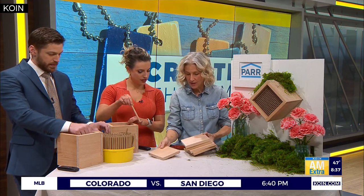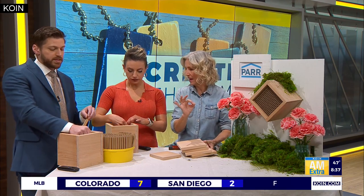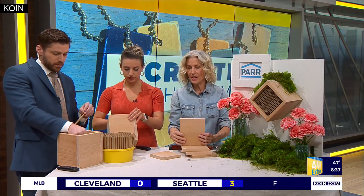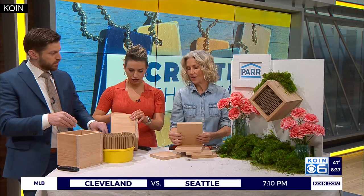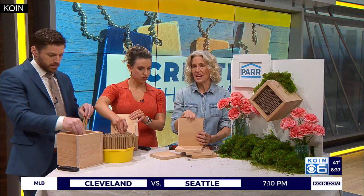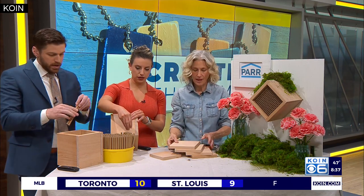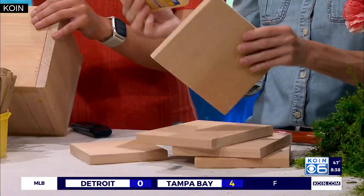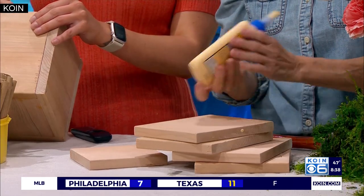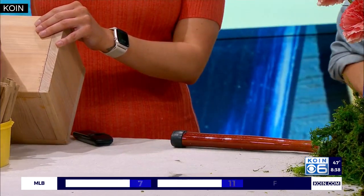It's four pieces that you can get. You don't want to do treated wood - no wood with chemicals, that's very key. So this is hemlock, and it's a one by eight. You're going to cut this in four pieces at six inches long. The eight inches creates this depth here that you have for the tubes. Then you glue each side together and you have the box.